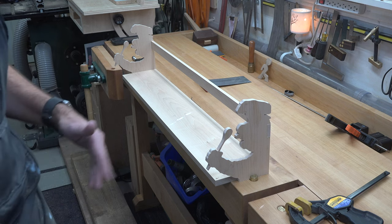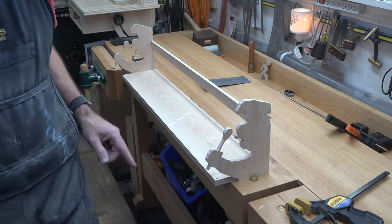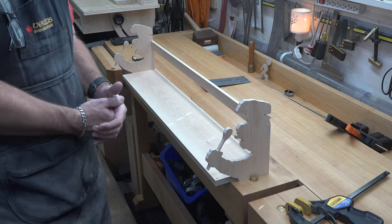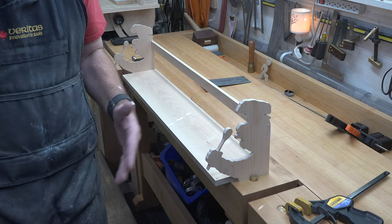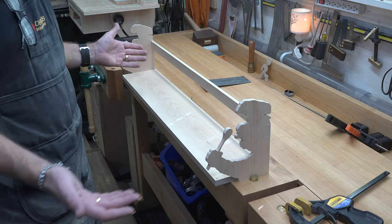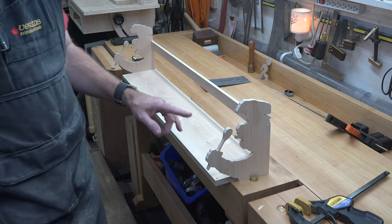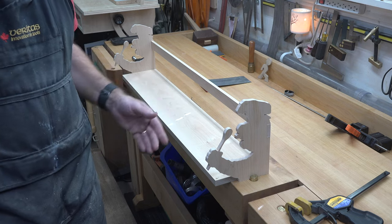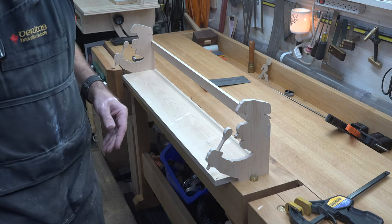The next thing that you're going to want to do before we get into mounting this bar and securing it into those notches is drill our mounting holes. Now, if you're going into a hollow wall, say with 16-inch centers on the studs, you want to put your holes at 16 inches to center. If not, in my case, I'm going into a plaster wall, so I pretty much have free rein to go wherever I want. So I'm probably going to come in about 6 inches from either side of my mounting rail, and I'm going to drill and countersink so that we can get a nice flush screw mount once we mount it to the wall.